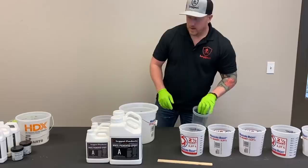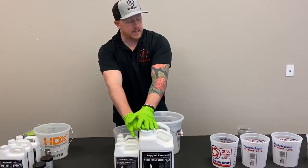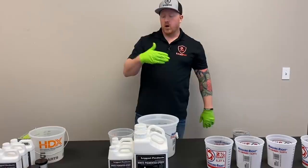And the first thing we want to do is we always lay out a base coat on the countertops. So I'm just going to take 64 ounces from this 1.5 gallons and mix it up so that we can just lay out just a thin base coat on the entire counter.